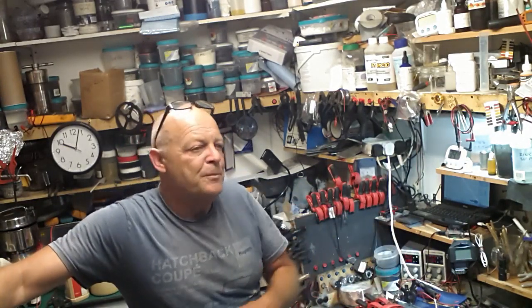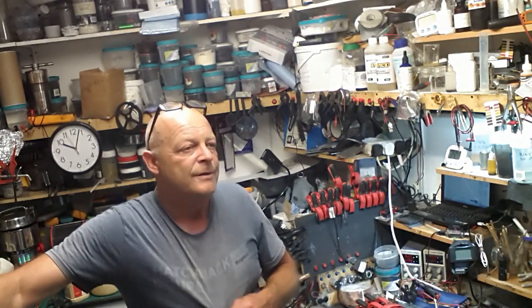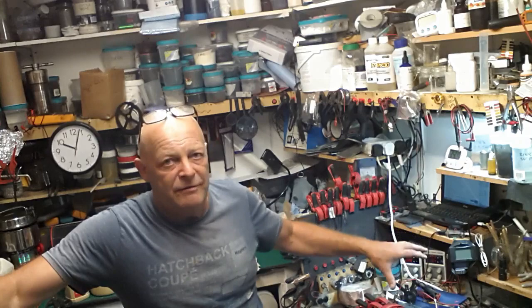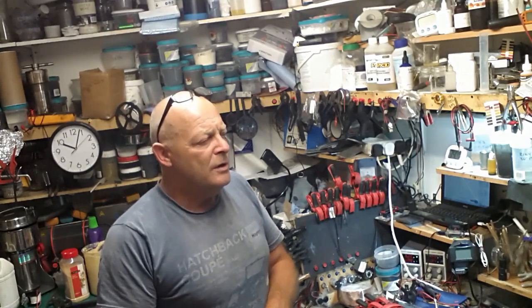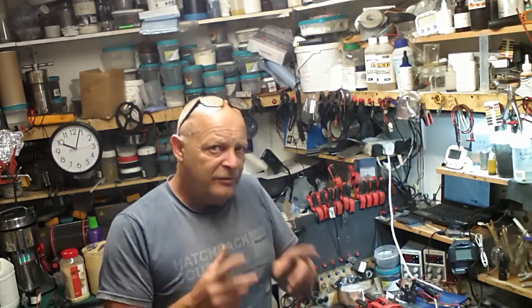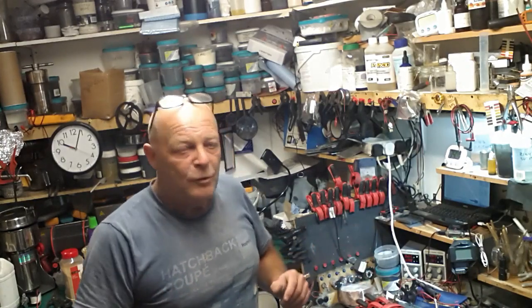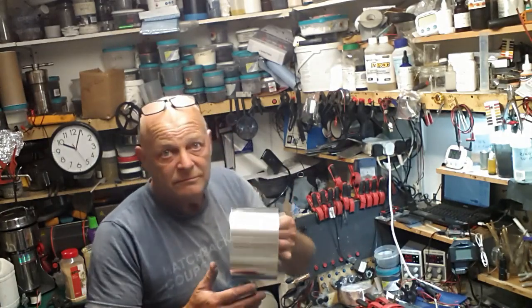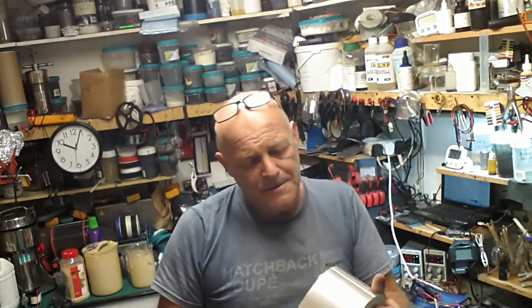I've built a new one today because I had some larger graphite plates delivered today from China. It's not going to stay there. It will be gone. But the significance of this one is I've got 1 gram of active material on it. So that's half a gram on the anode and half a gram on the cathode. But the other significant thing is I've done away with that aluminium plate and I'm now using aluminium foil. This stuff. So that is my collector now on my anode, or my negative,